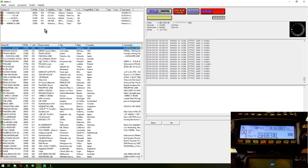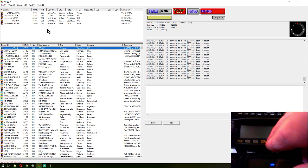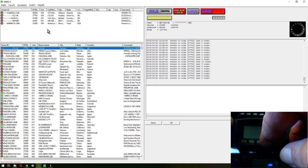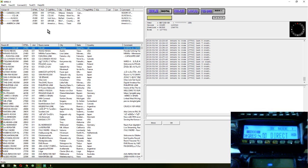So how do we get into WIRES-X mode with the radio? Very simple. Turn your radio off. Hold in the DX and the GM buttons together and then press the power on button. And you'll see it says Yaesu WIRES-X Direct. You'll notice that the red boxes at the top of the screen that were red now pick up the fact that you've got a digital radio and that it's connected to the PC. And away you go - it's that simple. You are now on the WIRES-X system.